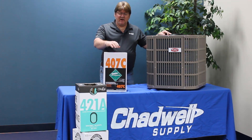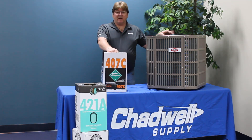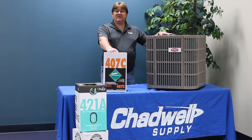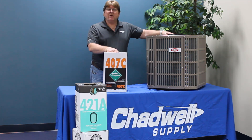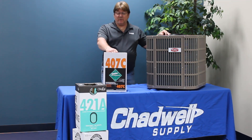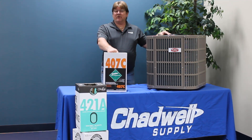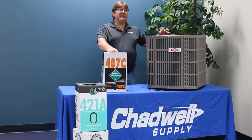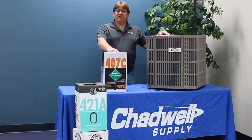It's not to the concern that it's going to double their electric bill. What it means is it will increase the amp draw at higher temperatures and starts dropping out of efficiency at about 95 degrees, which increases the head pressure, which makes the compressor work harder and pull more amps, therefore using more electricity. But when you do the numbers, it works out to about $3 to $5 increase on a resident's electric bill over the course of a month. So if it satisfies the thermostat and makes the resident happy, that little bit of an increase shouldn't stop you from using this refrigerant.